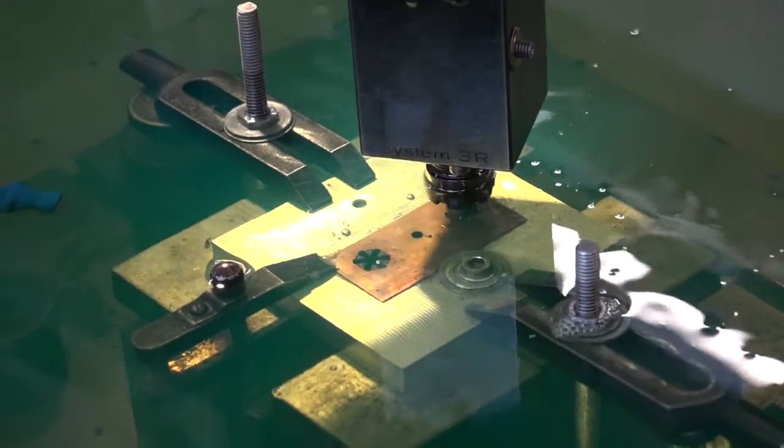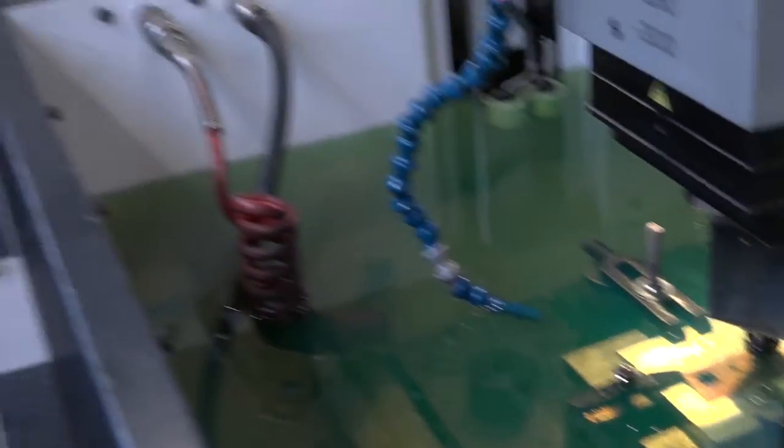This is EDM sink — electrical discharge machining — if we refer to it now to distinguish it from the other EDMs we have in the shop. What sort of component would you manufacture on this? A component in 3D, where the wire machine will do 2D and the fast hole drill just puts a hole in. It's just 3D.